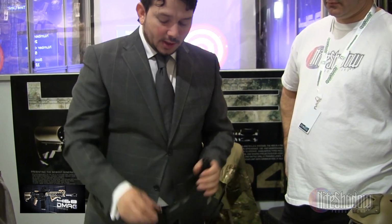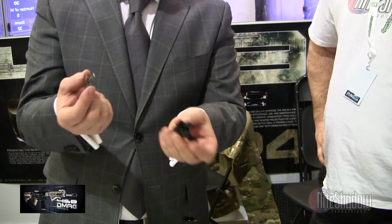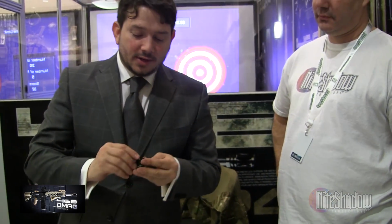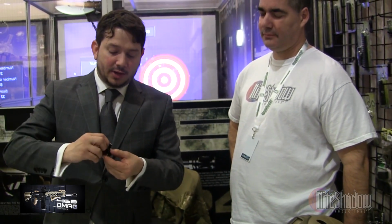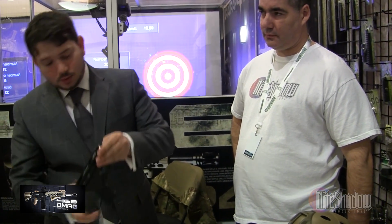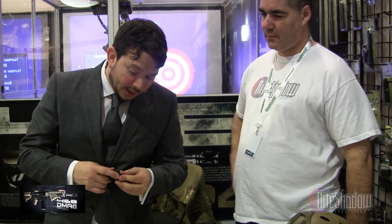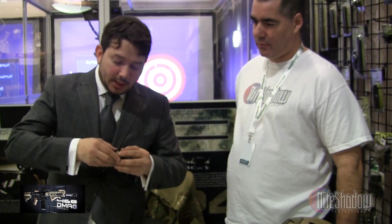Okay. Let's go ahead and look at the mechanism for the DMAG. There's a spring right here. So just for the assembly, everything is toolless, so there's a little hook on it. It just slides on. Again, this avoids the need of having these little tiny screws or anything anywhere. So at this point, you just make sure that's on there. And that's pretty much it on that one. There is a hole to align the pin that we just removed. Okay, just align it.